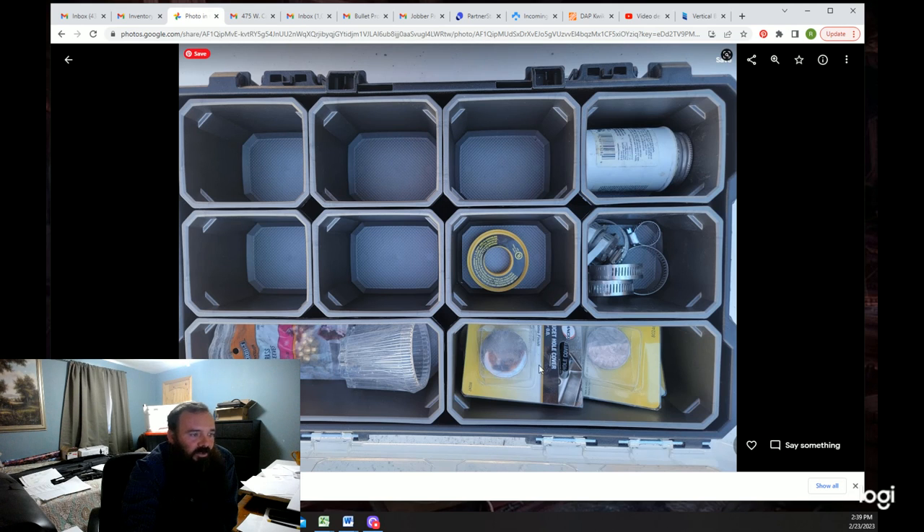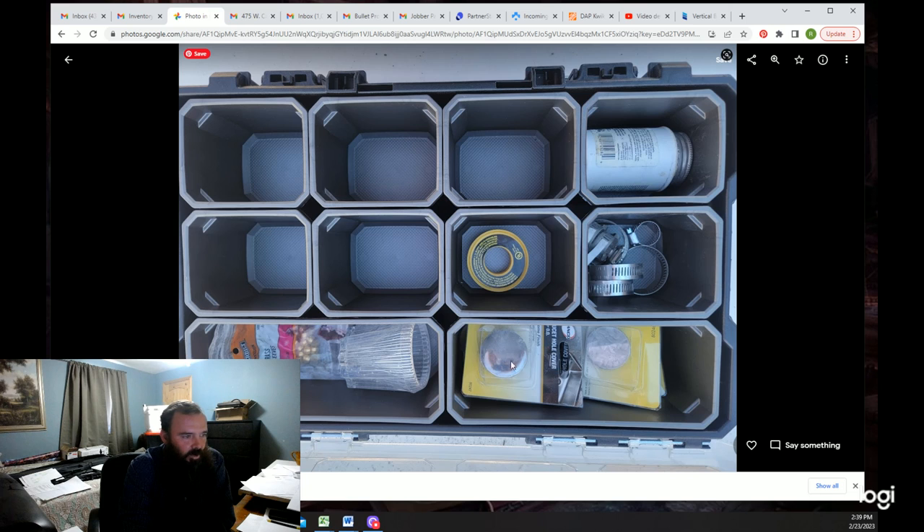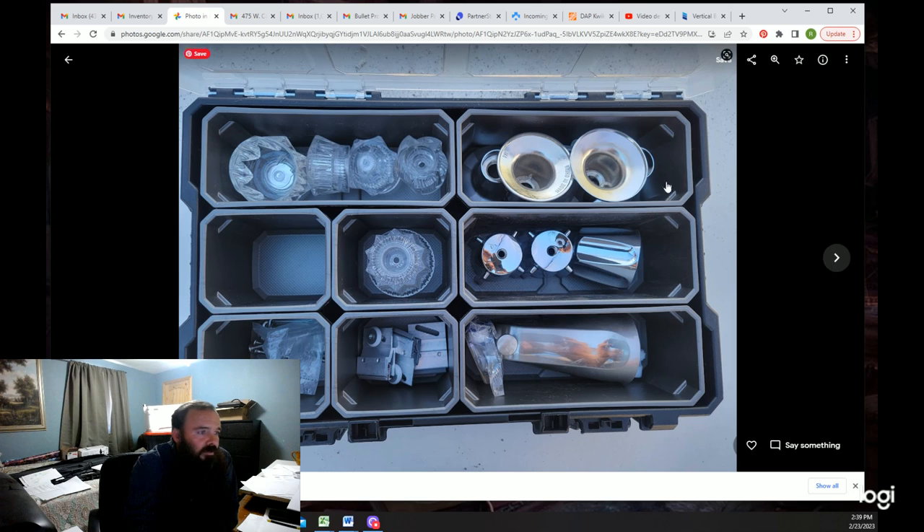Here's kind of a miscellaneous plumbing and kitchen kit. These caps are very handy — they go on a kitchen sink's standardized hole. A lot of houses have a faucet and a separate sprayer, but the faucet I install is a pullout, so now there's an old sprayer hole to fill. These caps fill those holes. These clamps are generally for the drain plumbing where the garbage disposal empties into the drain line.